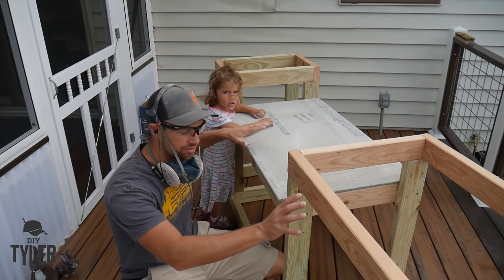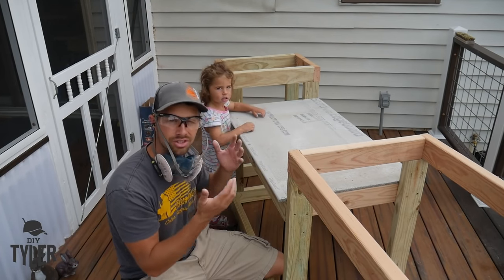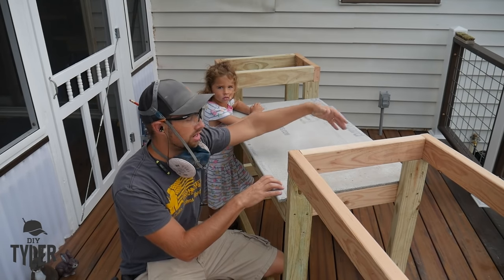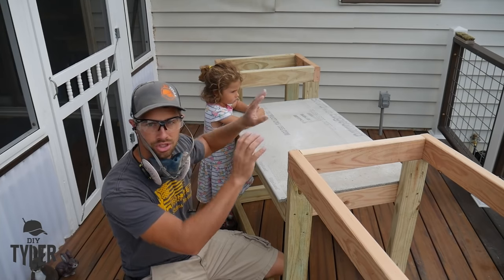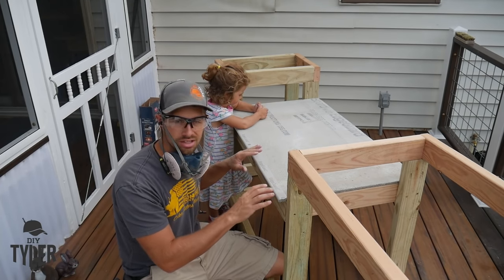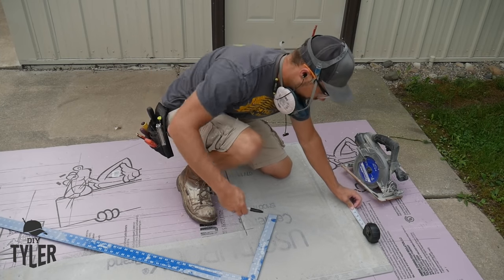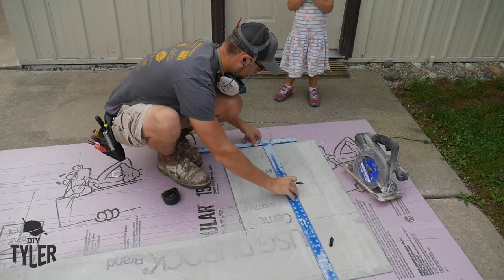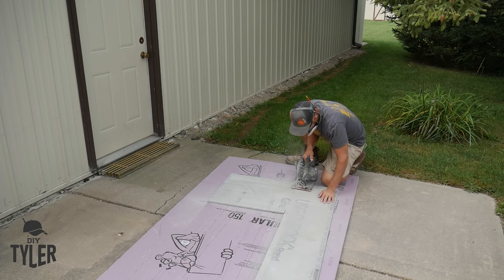We got our first kitchen framing section out here, and we're going to be using concrete board to make sure that we don't transfer any heat into the frame or into the house. The griddle is going to go right here, and we're also going to be using fire brick on the back side to make sure we don't transfer any heat into our siding. I'm using a circular saw to cut this concrete board — it's very dusty, which is a mess, but it also leaves the cleanest edge. We're measuring here to fill in the firebox of the griddle and also put some concrete board on the back.